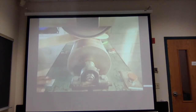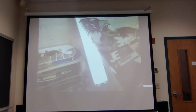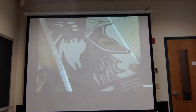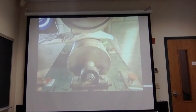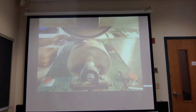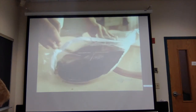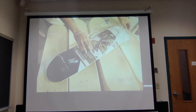The final step of the finishing process is applying the decoration. The bold graphic designs are printed on plastic sheets — the skateboard factory either buys them ready-made or produces them in-house using its own silkscreen printing equipment. Workers center the design sheet, then feed the deck through a machine that applies heat and slight pressure simultaneously. The heat — 200 degrees Celsius — induces a chemical reaction that melts the ink and lacquer. When the plastic comes off, the deck is finished.